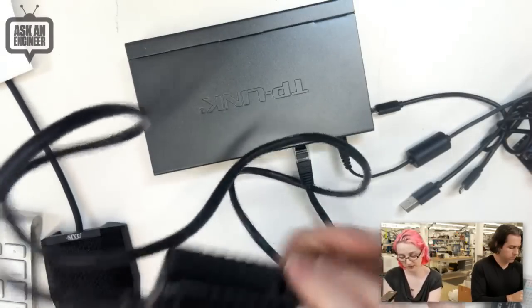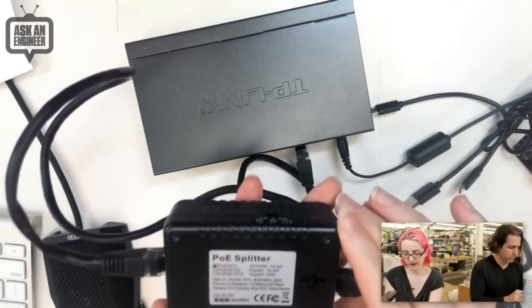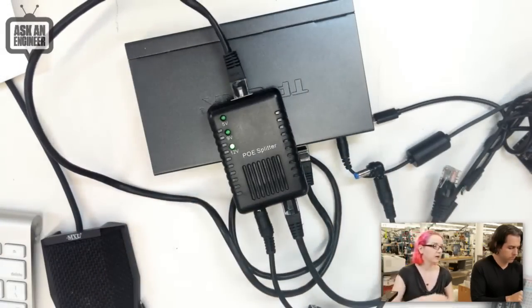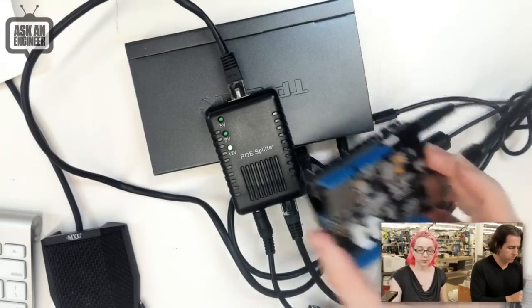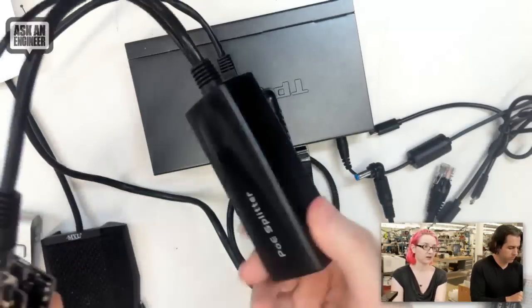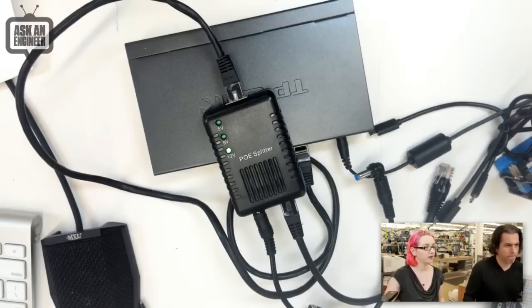It's still handy if you have that IEEE 802.3AF. So pretty cool, pretty handy, and good for those people who are building Ethernet-powered sensor networks, and then you don't have to have PoE support on your device, because this Ethernet shield doesn't have native PoE, and honestly the cost to add it here would be about the same as just having this plug. So there you go, about 10 bucks more and you're golden.